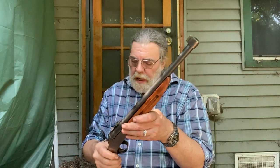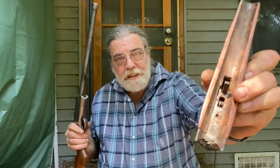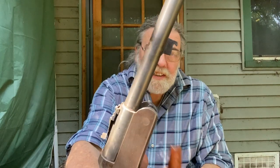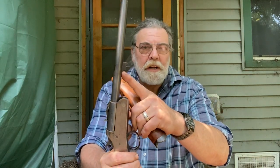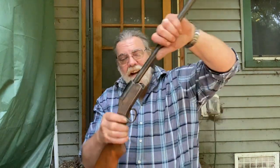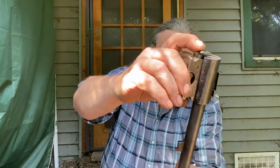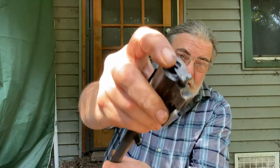I'm quite pleased with the way it's coming out, and it's been a lot of fun. To dismantle the gun, you simply pull down on the front of the foregrip, and there's a spring-loaded lever that engages this piece to lock it into place. I had to remove this piece from the 16-gauge shotgun barrel and mount it on the .45 caliber barrel, which I did by filing a flat and silver soldering it in place, which works quite well. Then you simply open it and pull the barrel right off. Here is the ejector — this lever under here allows it to release, which will happily kick an expended cartridge into the next county.